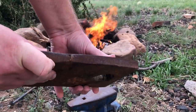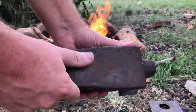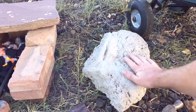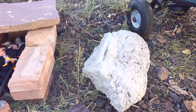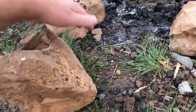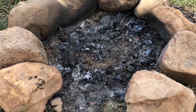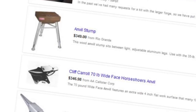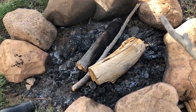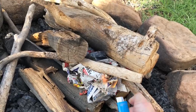You can use a scrap of steel or a cheap anvil. In my area we have Harbor Freight — you can run there and pick up an anvil for about $15. I've seen them on Amazon and other places. Really, any flat piece of steel or even concrete will work, though you'll probably damage the concrete if you use it too long. I've even seen people forge on a rock or a tree stump. And of course, if you want to go really professional right from the start, you can spend $300–$400 and get a pretty decent anvil. But what I'm trying to show is that just about anybody can walk out to their backyard right now and in about half an hour to an hour, you could be forging.